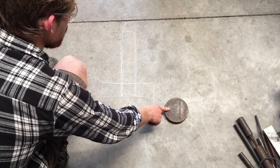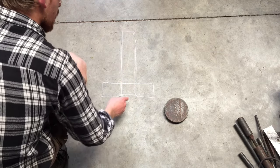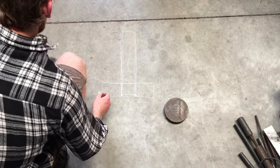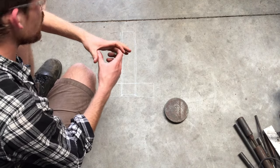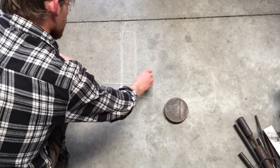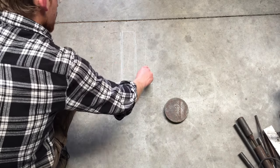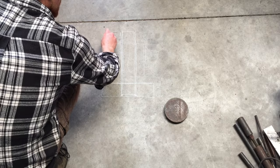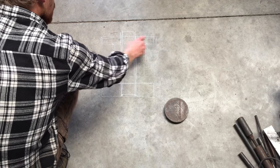I'm going to take this piece of steel plate, I'm going to bore a hole in the middle of it. I'm going to take a piece of 1.5 inch steel pipe, fit it into the hole, weld it from the underside, like so, and put it back in the lathe, face this, and turn this down to a close fit in the holes in the middle of the two covers, which are designed to take the stuffing boxes once they're machined out to size. So when I place the bottom cover, or the water end cover, and then the piece of 3.5 inch pipe, like so, then the steam end cover, that'll all be held in perfect alignment by this 1.5 inch pipe, then I can get in here and weld, weld, weld.